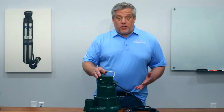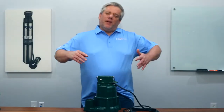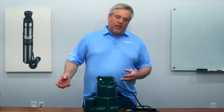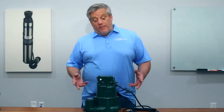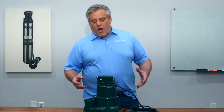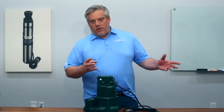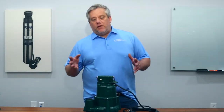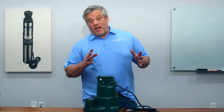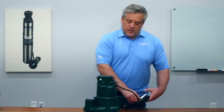A lot of these are used in sump applications, and there's some confusion about sump pumps versus effluent pumps — they're pretty much the same thing as far as design and volute size. Sump pumps tend to be a little smaller in some applications but can be bigger too. In a sump application you won't have solids coming in; it's mostly just water. Effluent means final treated sewage water, so the water should be pretty clear with not a lot of solids.